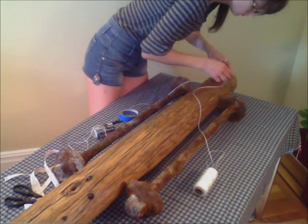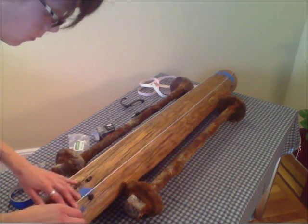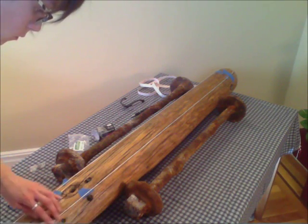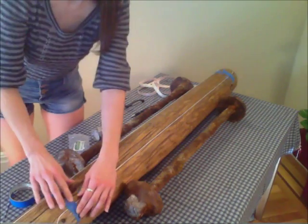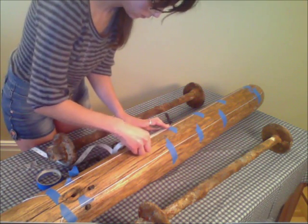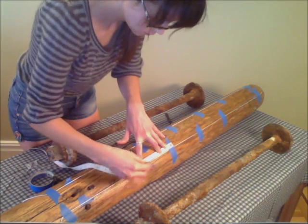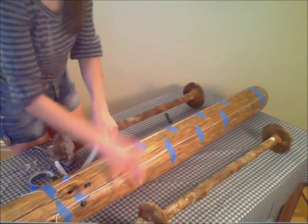Before I hang the coat rack, I'm going to install the hooks evenly over the front of the post. There will be two columns of hooks that I've marked with a string held down with painter's tape. The string ensures a straight line of hooks. You'll want to install the hooks towards the upper part of the post or board — if they're too low, you won't be able to hang a coat without it touching the floor. Evenly measure out and mark where you want the hooks to be placed.